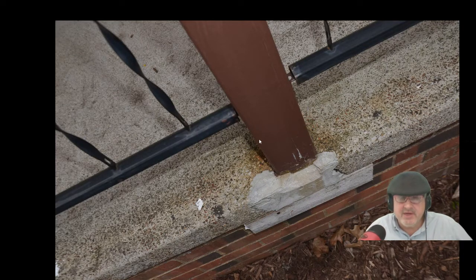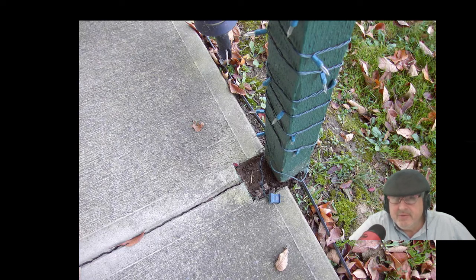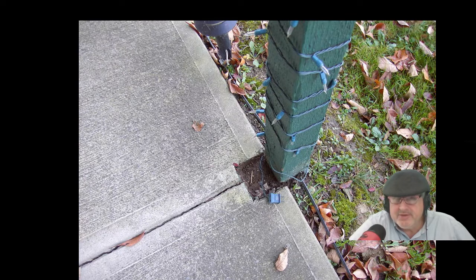Columns like this one you saw earlier — you've got to have bearing. You can see how this is cracked out. Why did it crack? Because it wasn't embedded enough. It's being loaded and it kicked out the concrete — they could slip out. You want your column base to be properly anchored. Here you can see how this anchor isn't good; it's just a piece of mortar joint. Here's one that moved out.